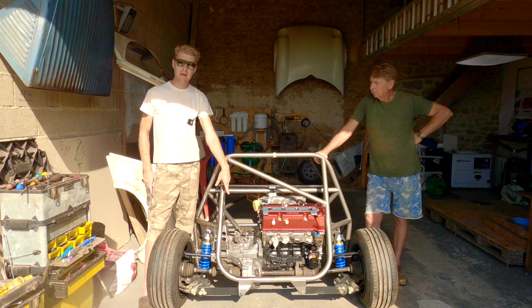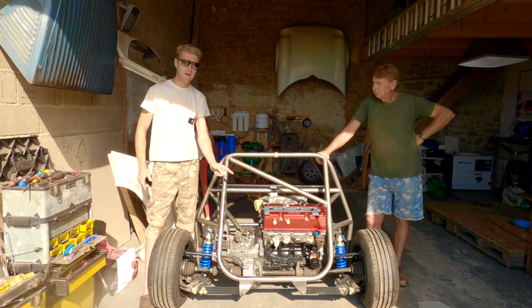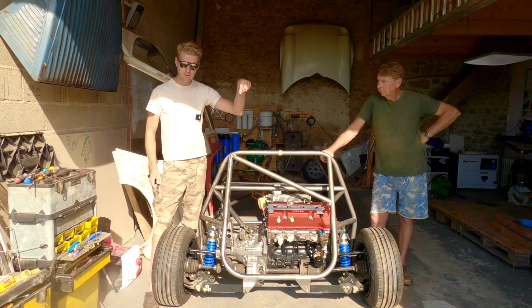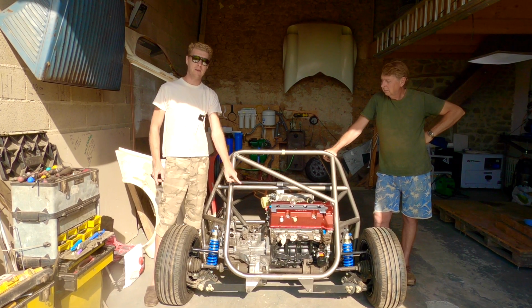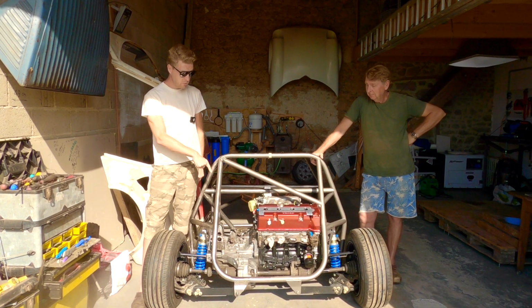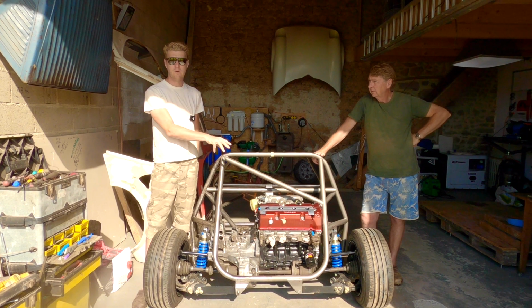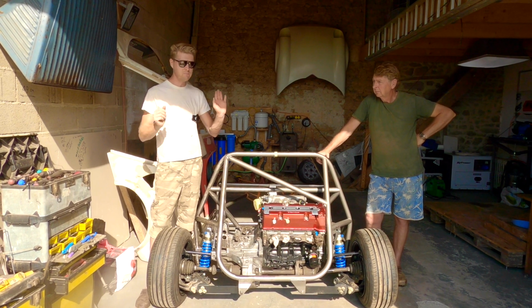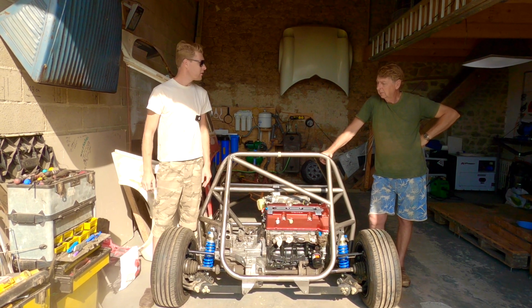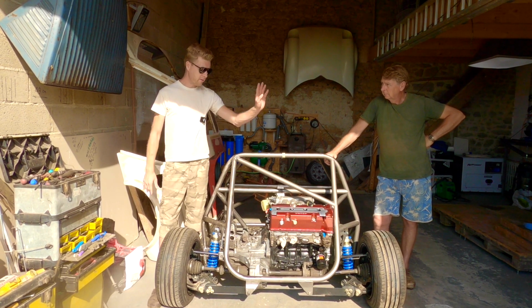And it's got the gearbox, the second gen DC5 Type R European gearbox, which doesn't have the factory limited slip diff because I didn't want one. But it is a 6-speed manual with the silly lockout for reverse, so you can't start it without pushing the clutch in, which we'll get rid of because I don't like them. They damage your thrust bearings in the engine.